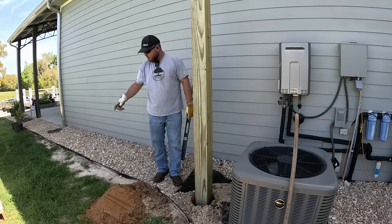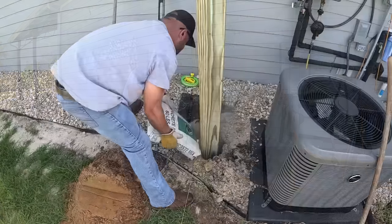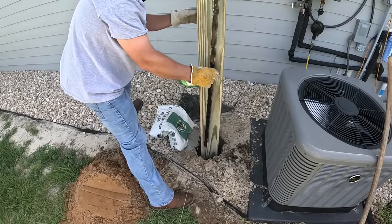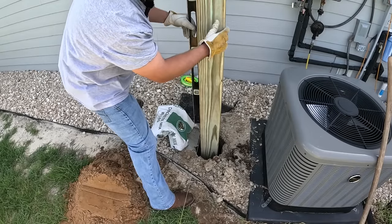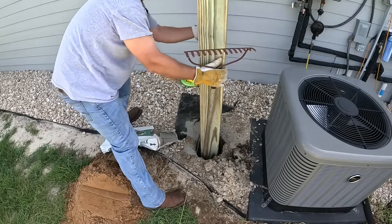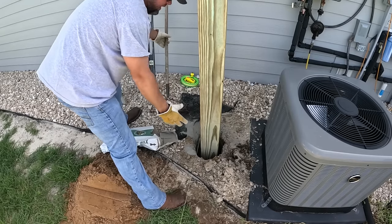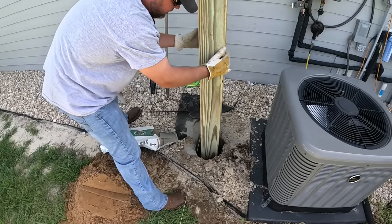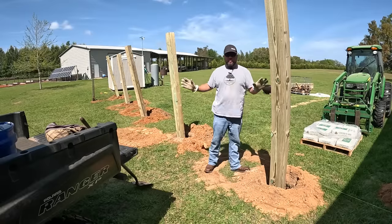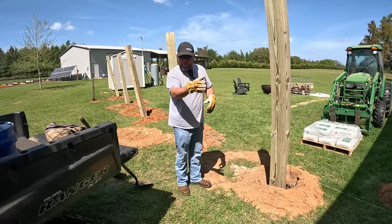It looks pretty good right there, so we're going to grab a bag of concrete and pour it around it. I'll stop there while I can still shift my post around a little and check — still perfect. Now I'll pack my dry mix in while still checking for plumb. At this point we can wet the mix and let it harden up overnight, or you could pack more dirt in and let the natural moisture harden it over time. Now we'll just repeat the process with all these posts, getting them right up to the string line — I like to stay a tiny bit off the string so one particular post isn't putting a wave into my fence.